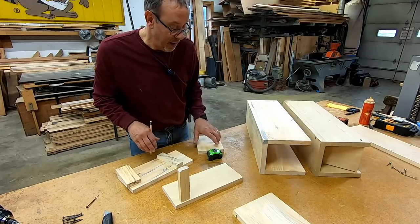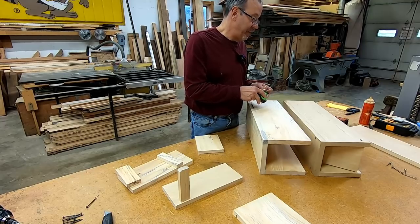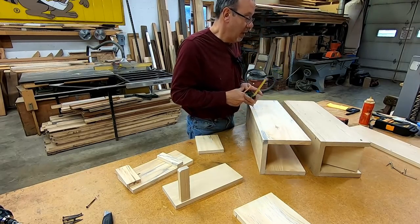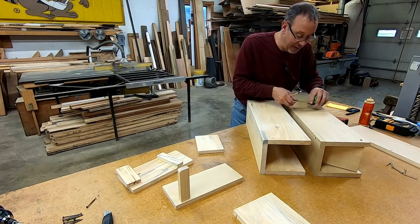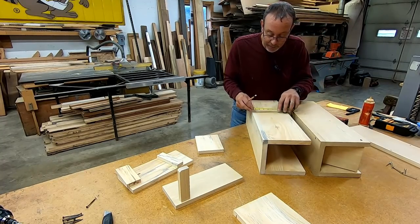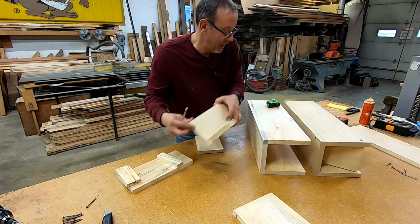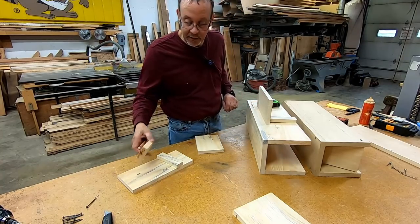that when it goes. Now, on the side of the box trap, we're going to have to lay out the pivot point. So we'll do it from the back of the trap. So 13.5. And we're coming up off of the board itself, not the very bottom, because that will make a difference. It's going to be 1.25 inches up. And that will be your pivot point that's going to line up with this. So if you do this correctly, everything should work when you put it together.